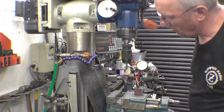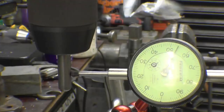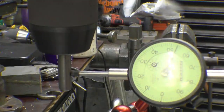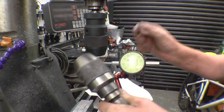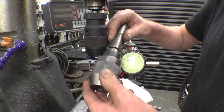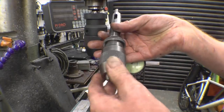And that's got a couple of thou out. For a cheap chuck that's going to be drilling holes on a milling machine, I'm quite happy with that — very happy indeed. So that's got a couple of thou. It's kind of a copy of this — that's an Albright chuck, that's the real one. I've got two of them: one was given to me and I bought one at a car boot sale. That's the other one that I use on the lathe — Albright.